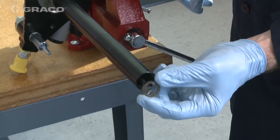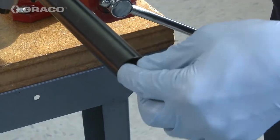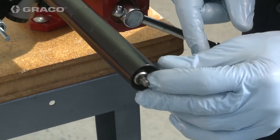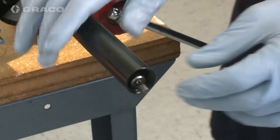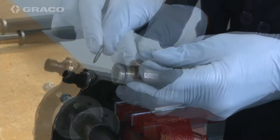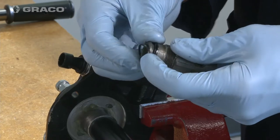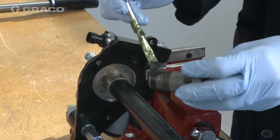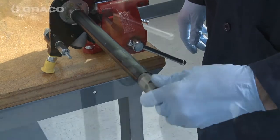Place the spacer into the pump lower tube until seated. Attach the shuttle valve to the shovel rod with the notch upward. Replace the two shovel tube backup rings and the o-ring and grease lightly. Replace the shovel tube into the pump lower tube and torque to 30 foot-pounds.